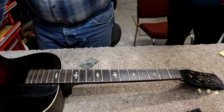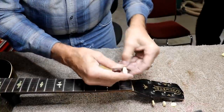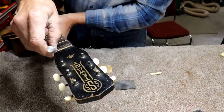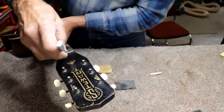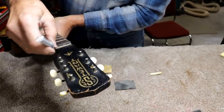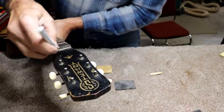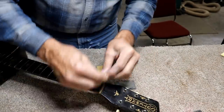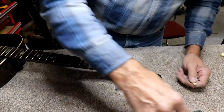I'm going to move on and look at gluing up these broken spots. I've cleaned up the nut, got all the old glue and junk off of it. It's always a good idea to take and scrape the end of the fretboard — you can see junk popping off. I don't want to remove any wood, just get it flat and clean so that when I put the nut back on it will match up perfectly. You don't want any gaps right here because this is where your intonation actually starts. That looks real clean and tight now.